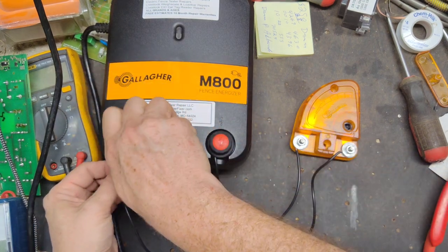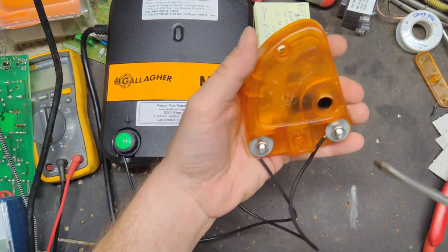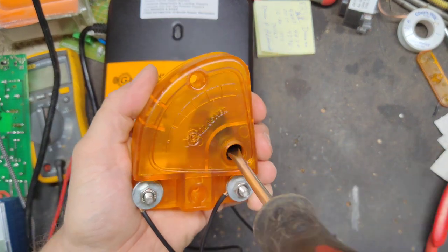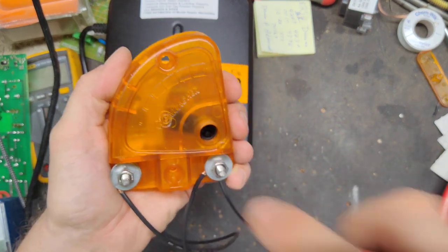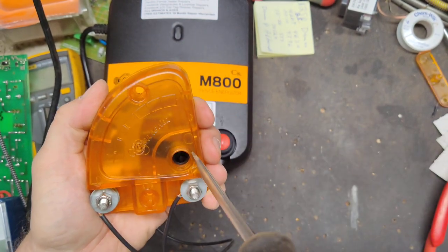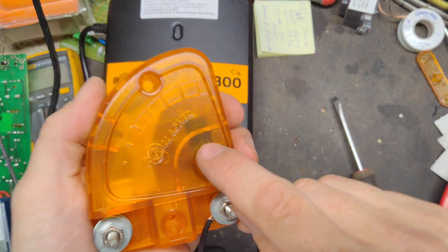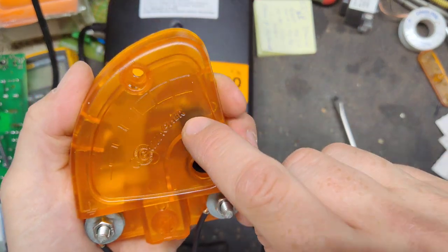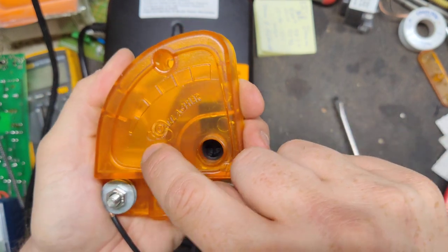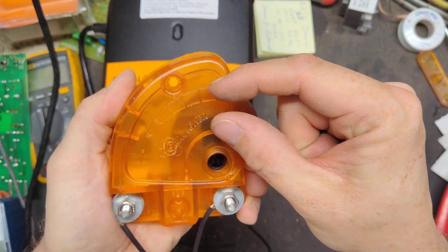Before you power it on, electrically it's done, but there's a little screw on here that you can turn with a flat screwdriver or a Phillips screwdriver. As you turn it, it moves that little lever inside there. At the very highest point, at 12 o'clock, that's the widest that the gap can be. Inside this little black plastic piece, there's a little metal tip on the end, and a metal plate that runs up inside here, that silvery looking thing in there. So right now the gap's about that far apart roughly.